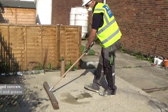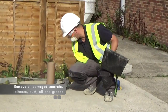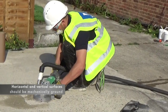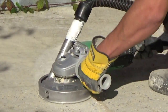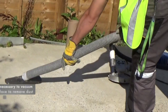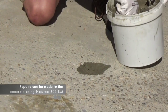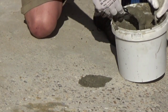Prior to application of Newton 107F, the surface should be prepared by removing any damaged concrete, laitance, dust, oil and grease. Both horizontal and vertical concrete surfaces should also be mechanically ground, vacuumed and cleaned. Whilst brushing alone is enough to remove a certain amount of debris left after grinding, it is necessary to vacuum the surface in order to fully remove any remaining dust. In cases where there is honeycombing or damage to the concrete, repairs can be made quickly and easily with Newton 203RM.